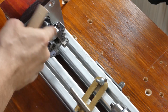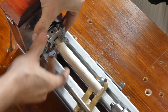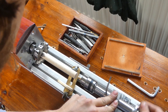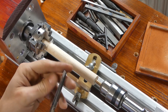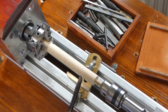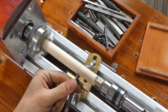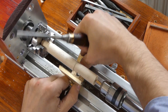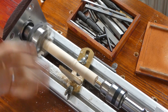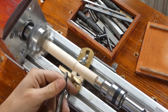I'm still missing the live centers, so for now I'm just gonna hold it in the jaws on one side. On the other side I made this brass pin right here. I've kind of modified this chisel to be a little more acute with the angle, and it should be okay. I made this rest to actually do metal turning — kind of a watchmaker's type of rest — but I'd probably make another longer one for wood turning.